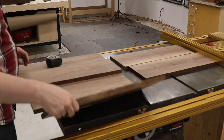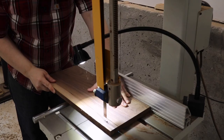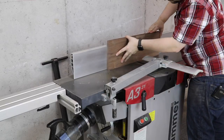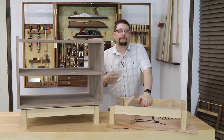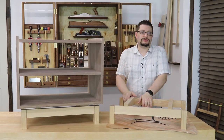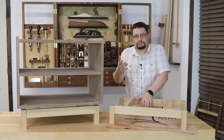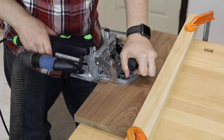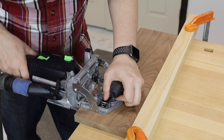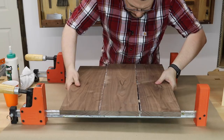Now with everything milled up, I was able to take a look at everything and figure out where I wanted to cut all of these for the same width, jointed my pieces, made the cuts at the table saw, and got everything to a uniform width. Once that was done, I wanted to glue these panels up. For this project, I am using a Domino DF500 for the majority of all of this joinery. Why not use a Domino to help keep all the panels aligned? I cut Dominos along the length of all the boards, depending on the length of the board and the number of Dominos needed, to help keep everything aligned during glue-up, and that worked out perfectly.